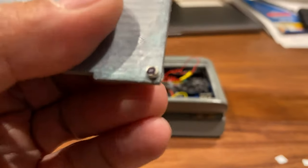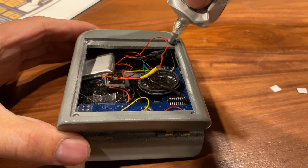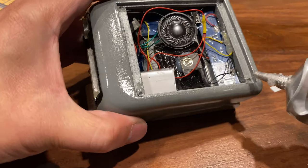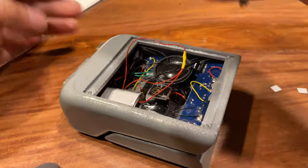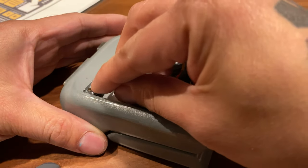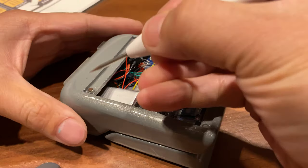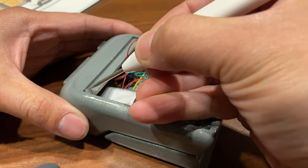This is me just making sure everything's marked. I'm adding E6000 into the four holes — I'm using E6000 because it's less goopy than hot glue and takes longer to dry, so it's more forgiving. Grab one of the magnets and make sure you don't see the Sharpie, because it should be on the bottom. If you're seeing the Sharpie marking, turn the magnet around — you want the ink facing downwards. Use a little tool to shove the magnet in, and do that for all four.